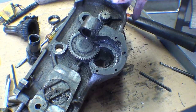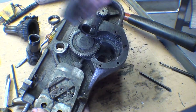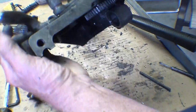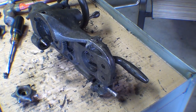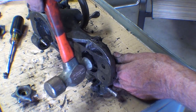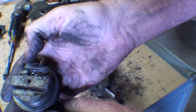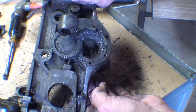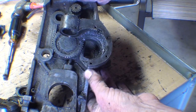Now looking at the rest here, there's really only two gears left and the mechanism for the half nut lever. Not all of this will be taken apart - this may be enough for me to clean it properly. Look at the chips that are inside that clutch - holy moly. I wasn't going to take the split nut lever out but it's easy enough - just a matter of backing off this screw which was kind of hidden. It's packed with hardened, probably original, factory grease. It's a bit of a Chinese puzzle such that I'm wondering if I'll ever get this thing back together. I might have to refer to my own video. Thank goodness I have documentation.